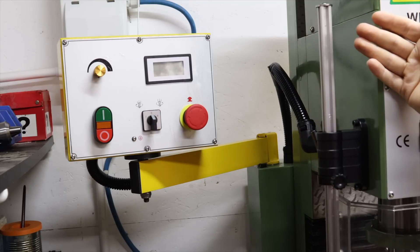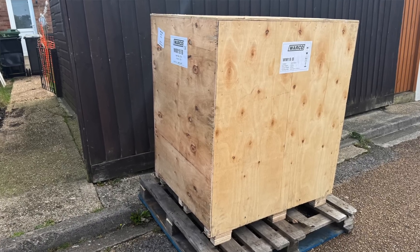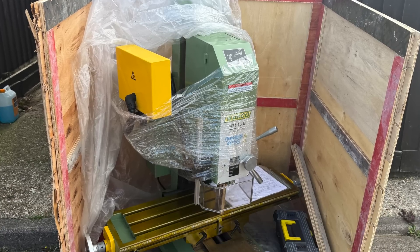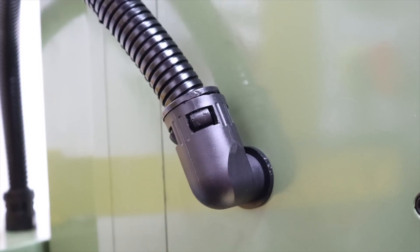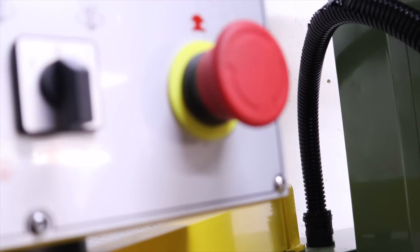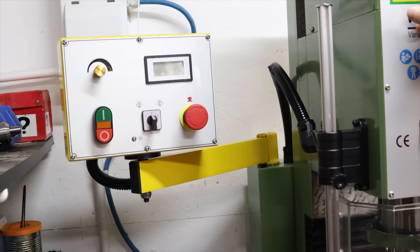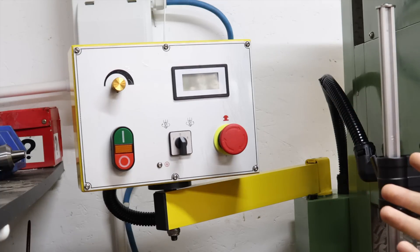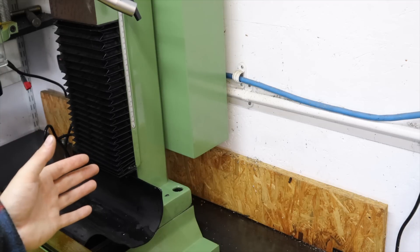One of the most troubling things when installing this milling machine was the wiring. As a small home hobbyist, I don't have the lifting equipment to lift this machine as delivered, so I had to disassemble it. One of the main things we removed was the head, and this one has a lot more wiring than the old mill. There's a control cabinet at the back with wiring going up to the head and over to the control panel. The spindle RPM wiring goes all the way through to the control panel, so you can't just unwire it simply - it was fiddly and took a fair bit of time.